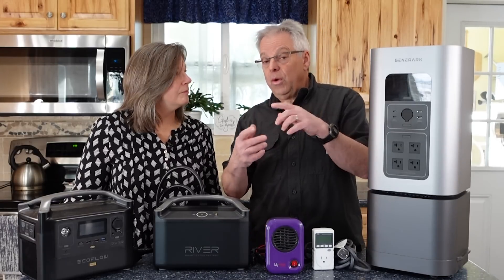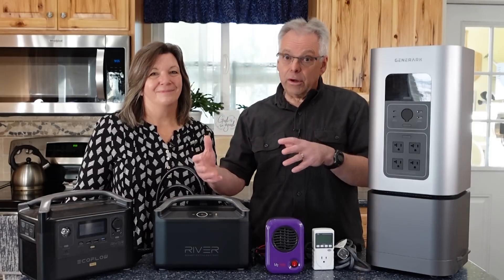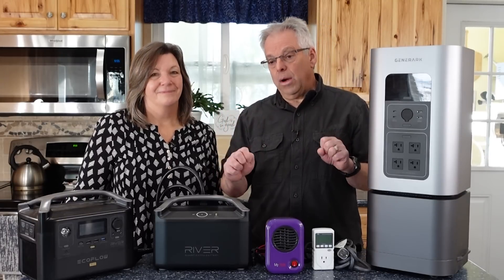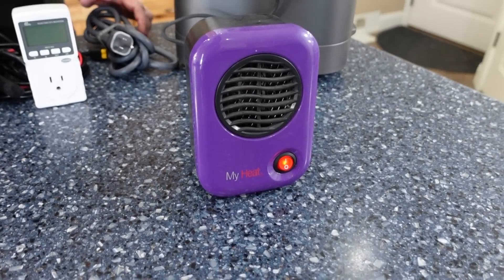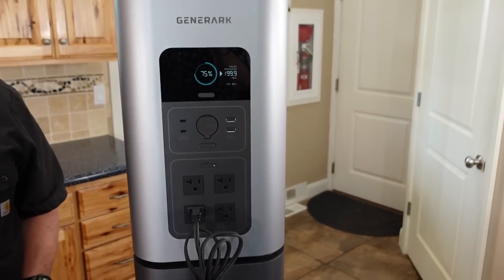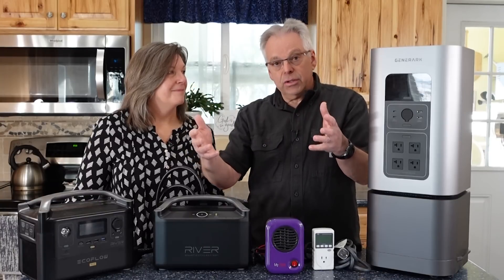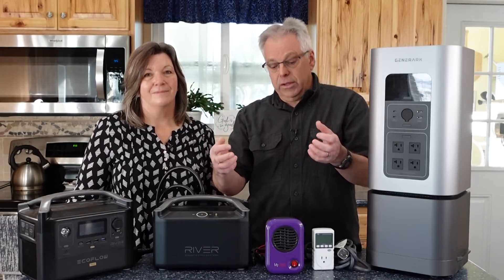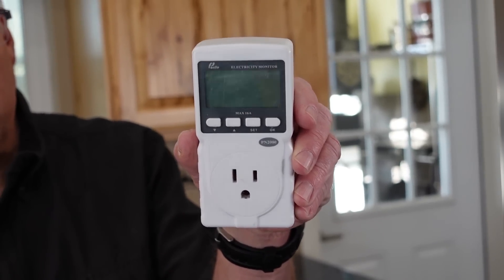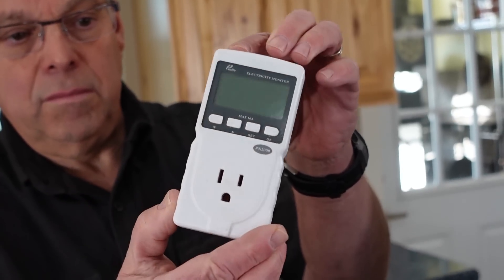And back to those who haven't even pulled it out of the box — whether it's intimidating or you're afraid you'll ruin it, or you think you'll figure it out when the time comes — pull it out right now. Use it, play with it, maintain it. About every four months, all this playing time is learning time. You learn that this kind of load really draws the battery down fast, while this kind of load can go a long time without dropping much. I'd encourage you to also get one of these energy consumption meters — they're very inexpensive, $15 to $30. You can measure how much any appliance uses both instantaneously and over time.